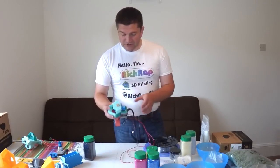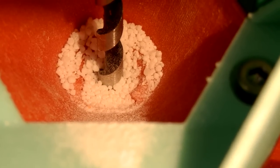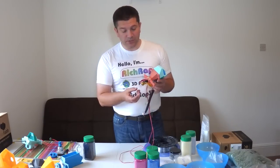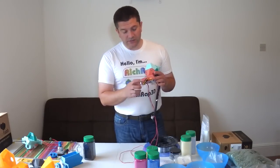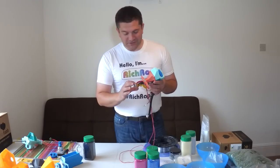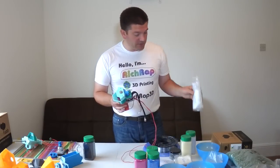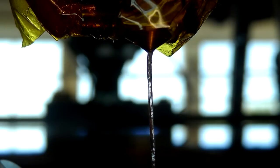After a few revisions, I settled on this method of driving the filament screw down. It still has to be cooled — you still use a normal fan as you would with a normal hotend when using PLA, for example. I apologize for having just taped my thermistor on; this was an experimental model — I wouldn't recommend doing that, always try and fix your thermistors very well. It actually produced some really good results with the granulated isomalt sugar, giving me real hope that this would be possible for other materials.